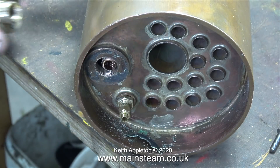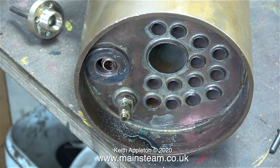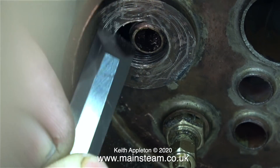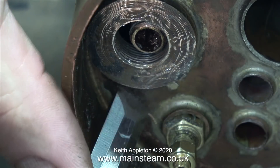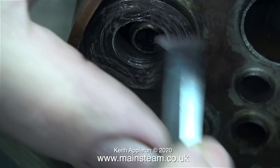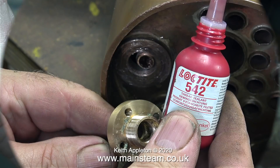As you can see in this clip, the gasket is not serviceable in the slightest. I only fitted this gasket for the hydraulic test, but now it's no longer needed and it's damaged anyway, so it's time for it to go. I'm cleaning off the residue using a chisel and I'm going to fit the dual threaded wet header bush back in place using some Loctite 542.